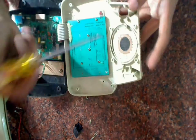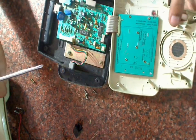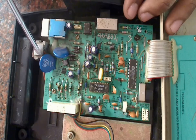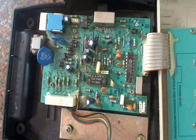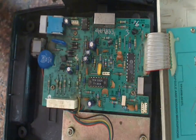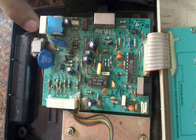This is a keypad board. There's a red LED here — probably a working indicator. Let's have a closer look at the circuit. There's also a metal plate, maybe added for weight — I'm not sure why they add these weights to the telephone. From this connector, input comes into the board from the telephone line. There are a few capacitors, probably to limit current. There's also a high-voltage box capacitor rated at 1k — I think that's 1µF at 250 volts. There's also a switch here which is used to hang the phone.